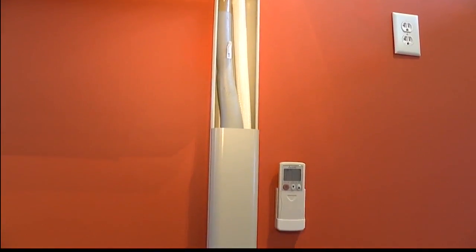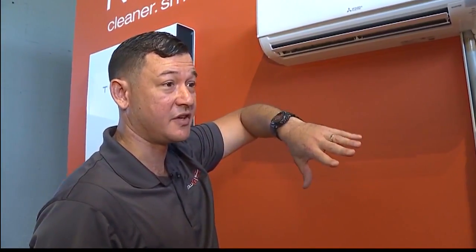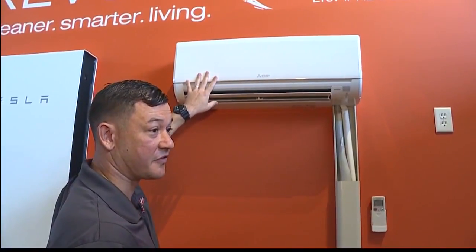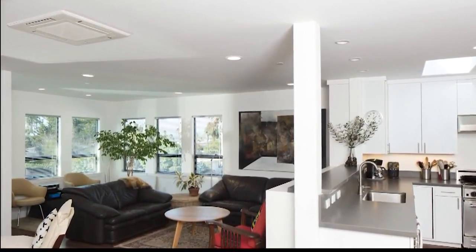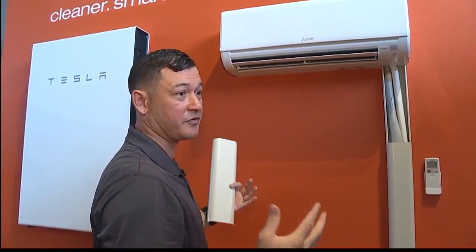Everything is sleek, nice and clean, and you don't need one of those big boxes outside every single room. What if you wanted to put an AC unit in the middle of your house? Good question. If you have an attic you can still have one of these indoor units in an interior room — we would run the refrigerant lines through the attic, and there would be a pump installed in the attic to power the drain line, because there's condensation that has to get to the outside. Another option — for folks who don't like the aesthetic of the wall unit or are dealing with an interior room — if you have a drop ceiling with an attic, they make a cassette version where the air conditioning head is actually in the ceiling. It looks like a central air conditioning grill, and it comes down when you turn the air conditioner on and cools the room from the ceiling.